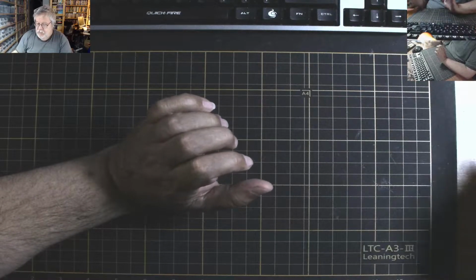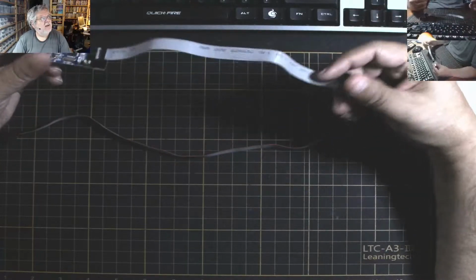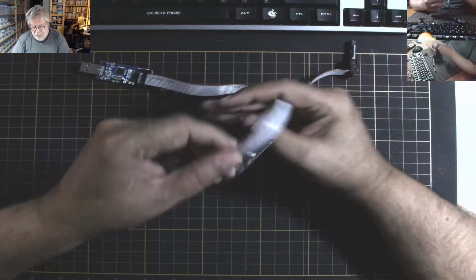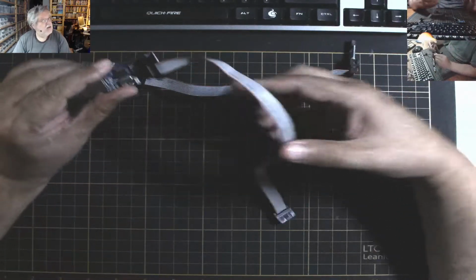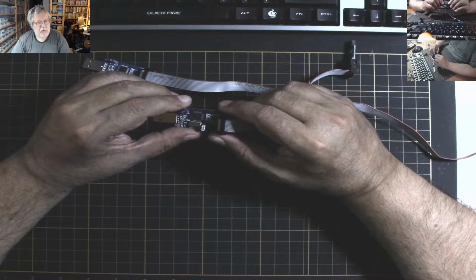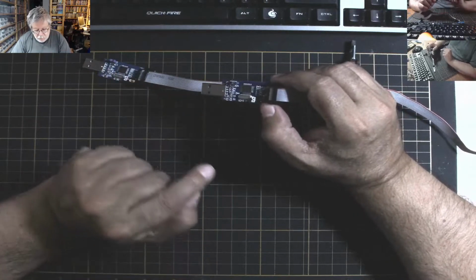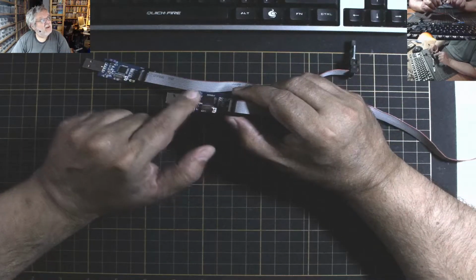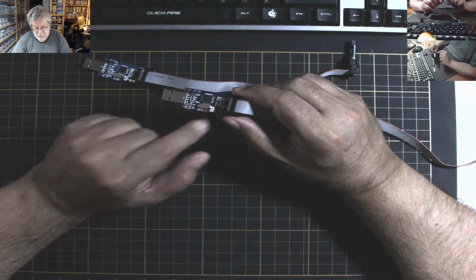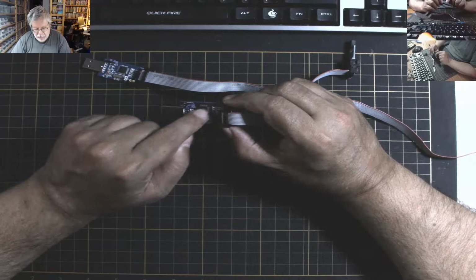So I worked on the retro tester programming last night and got it all done. First of all, how to update these things. When you buy these USB ASP programmers, I had to add extra jumpers to two of the boards, right here and here. This one will be needed in one part, and this one in another part. When you jumper this side here, you're going to be programming the board.